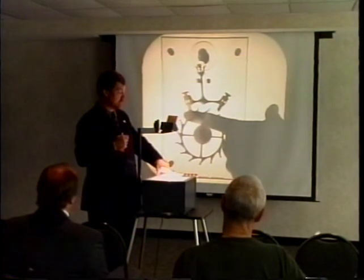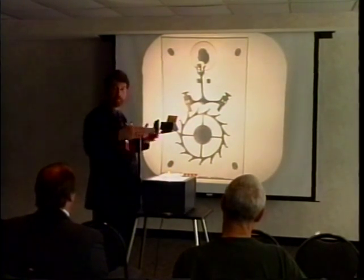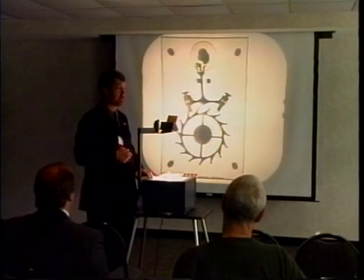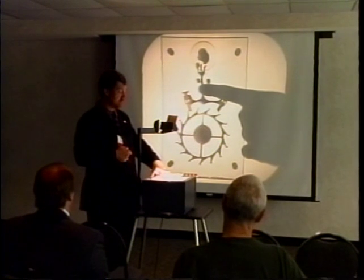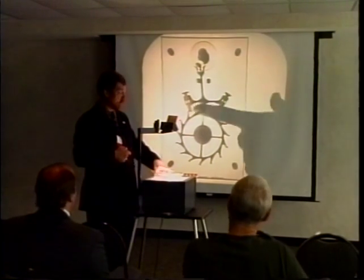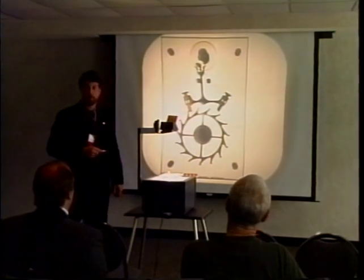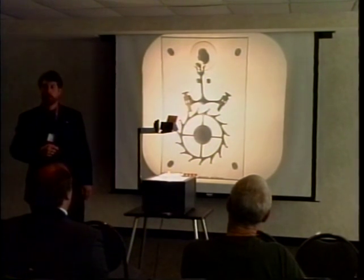The drop lock, this jewel was not able to get as deep into the escape wheel, so drop lock has decreased, just like the corner clearance. The fork or the shank is further from the banking pin when that takes place. So therefore, slide increases. And then total lock's going to stay the same again because we didn't do anything to the jewel. But the answer to the question is that it has the opposite effect on the jewel and corner clearance. Okay, not the total.